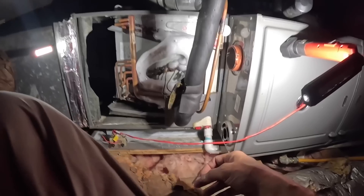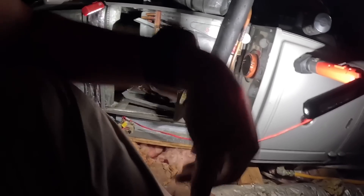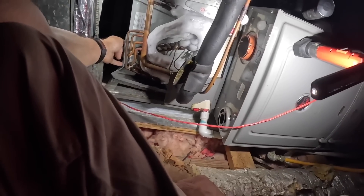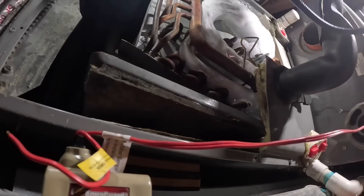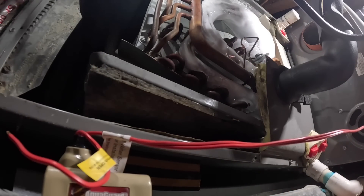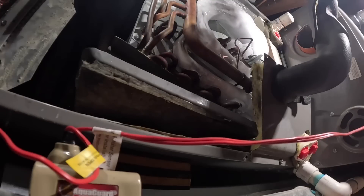And look at there — a block of ice. We know it's low on refrigerant because the whole thing's not iced up and it was not freezing outside. Let's see if there's some way I can get the ice out. I'm still going to try to do a leak search and see if we pick up anything in here. I can't use the ultrasonic because melting ice makes noise. Let's put this on high.